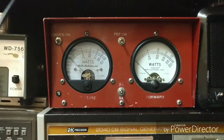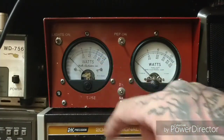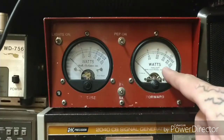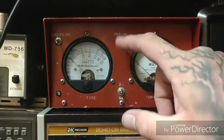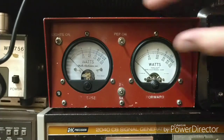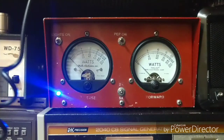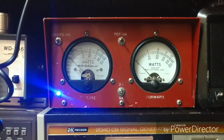We're going to start in average mode, as always. 25 watts in reverse, top scale. On this side, 1000 watts. We are in average mode. Hello, audio. Hello, audio. Okay — 60 watts average. Our average didn't really change too much from the last time we showed you this amp. Still about 60.